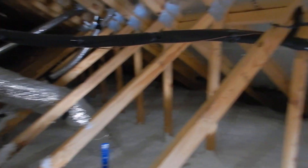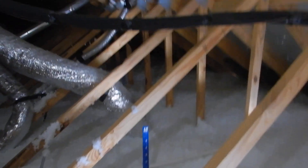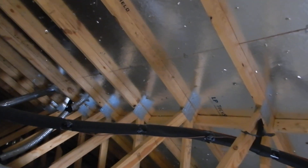Within a reasonable view, what we're seeing here is radiant panel decking, loose fill — we've got truss framing and loose fill fiberglass, about 14 inches of loose fill insulation. You know what I'm not seeing right there? Soffit baffles.